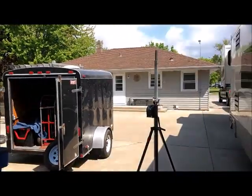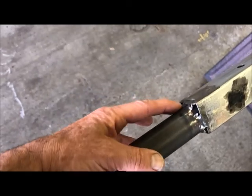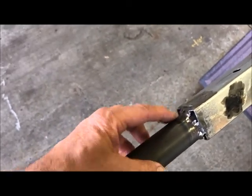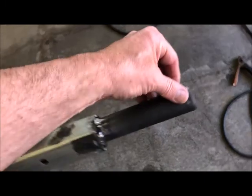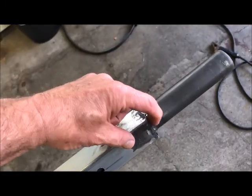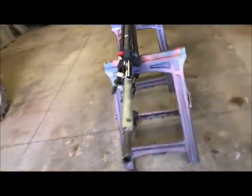Here's the second one — first one is still standing there. I got it drilled and plug welded and ground off. I did all four, and these don't look very good, but you really can't do anything with it because this is where the truss slides down on this part right here. At least I got it plug welded on all four so this ain't going anywhere anymore, neither is that one. Little fix on the Griffin heavy-duty crank stands.